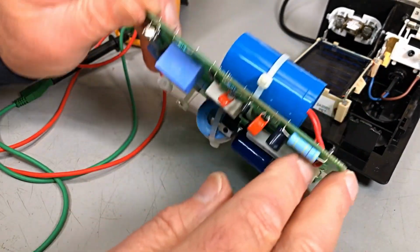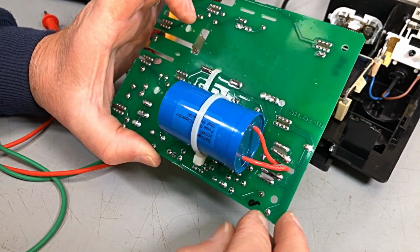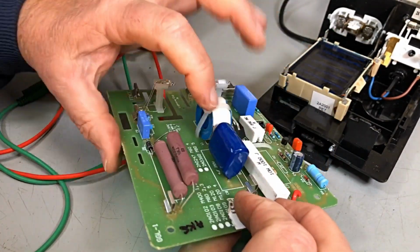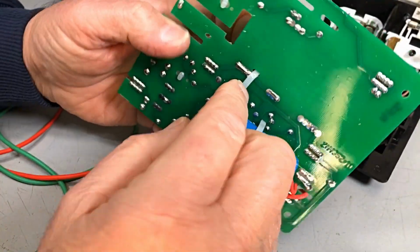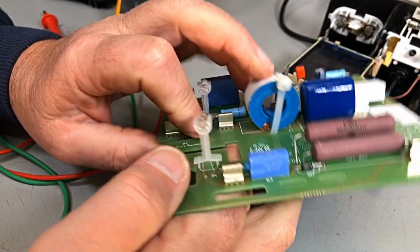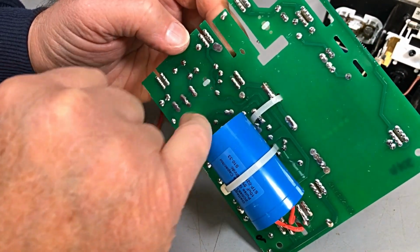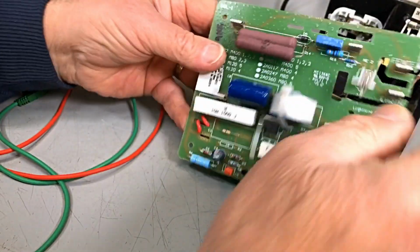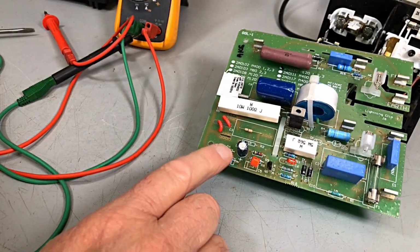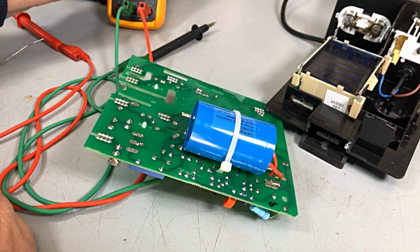Guys, I'm a bit curious about this resistor here, because it does feed our transformer, and there's some sort of, well, it goes through that cap up to here, to the coil or choke or whatever that is. I'd say it's a little choke over to here, and then he sort of disappears to here. I'm still very suspicious. Let's lift him up and see, and then we'll also do an ESR check on the cap. Let's check him. It's probably going to make a liar out of me.